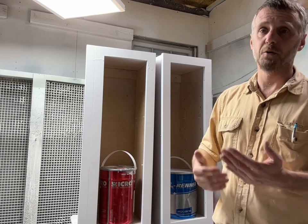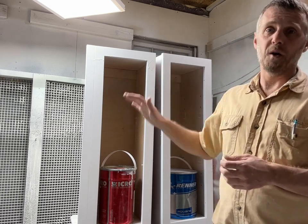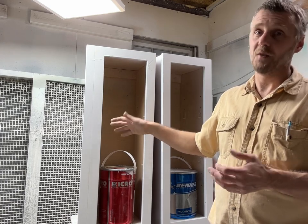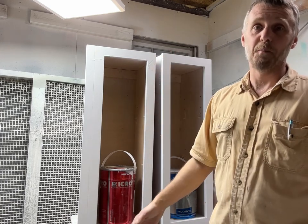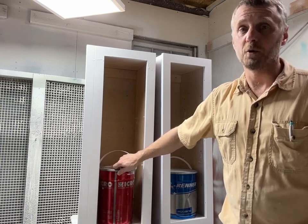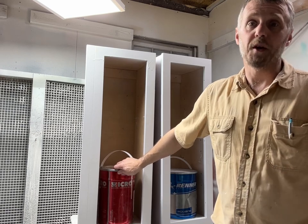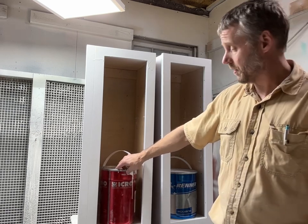But if you're spraying with an airless piece of equipment and you like to spray your doors hanging and you like to spray them hard, I'll just tell you right now, it's not going to work. At least from what I've done, it's not going to work. Keep your mils down to, you know, 4 to 5 wet mils. Keep your temperature right. It's going to spray nice. The stuff sprays really, really well. I mean, it sprays beautifully.